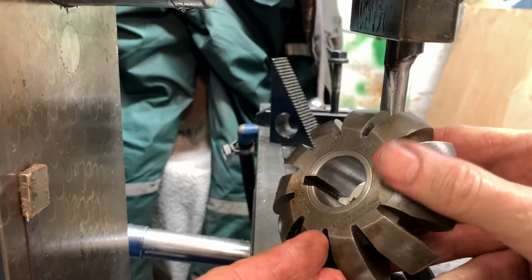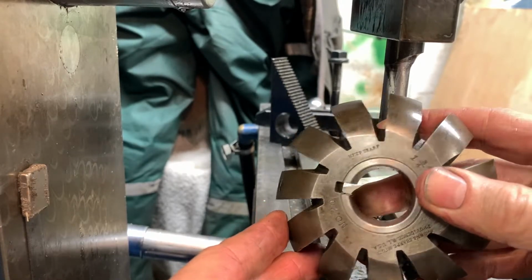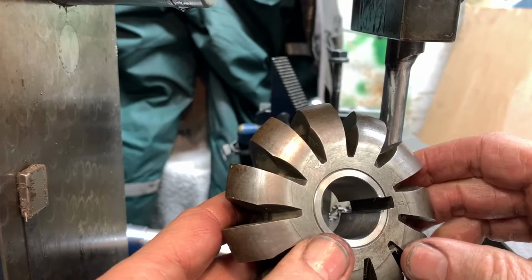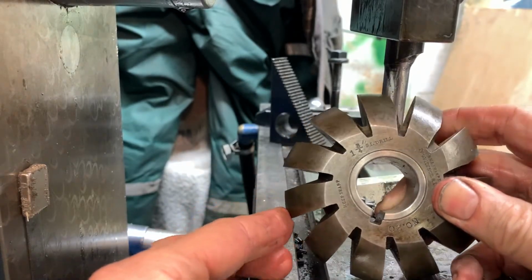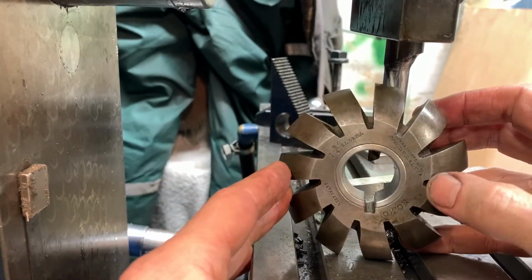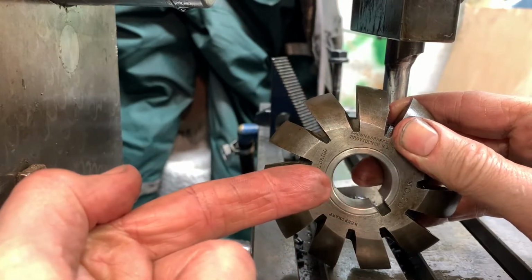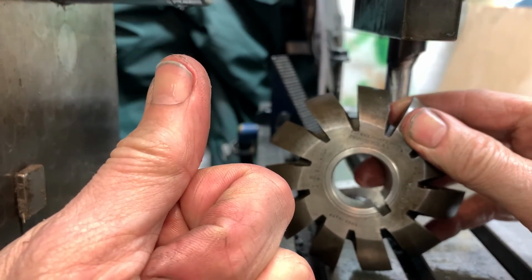And we managed in the end quite a tidy slot. I ran off a little bit. I think that was me when I had the tool with the wrong cutting angle, wrong cutting geometry. Alright, so there we go. Tom Senior slotting head, cutting slots in a sleeve. Shed guy, go on.